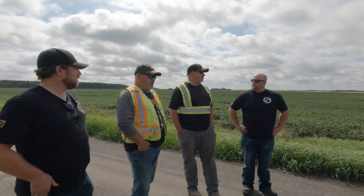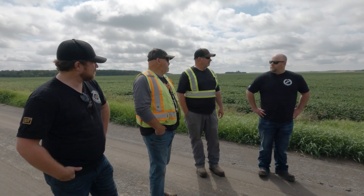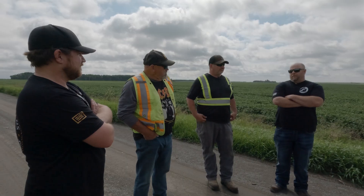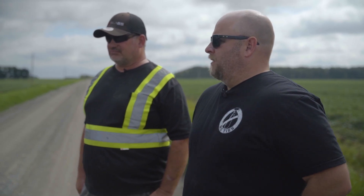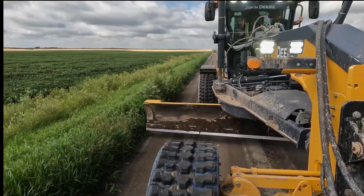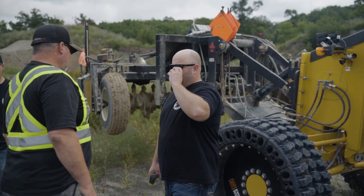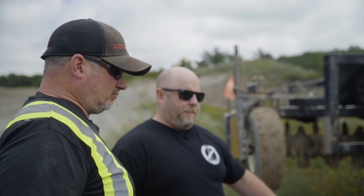You said you had some shale? There's a shale pit down there — we could go down and rip around in it. It's not as bad as a road; if you tear up the road you've got to go fix it. I could get in there and really torque into it. Jump in the cab with him as he's going, try some different speeds, then we'll go tear some stuff up in the pit to see what traction is like. This road's softer — the gravel was hard and you could feel it. I like how it's spaced out; I definitely like that room around the hub for servicing and maintenance. The fronts are running about 15 degrees hotter, so they're working more than the backs. The backs are fine; we've got to stiffen the fronts up to make them not bounce so much.